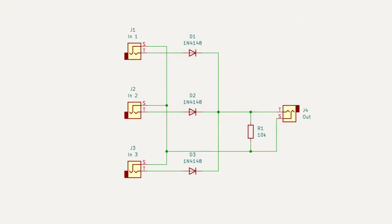There you've got the three jack inputs, and there's a diode on the output of each of those. They're all joined together and go to a single output which has a pull-down resistor across the output and ground. It's a passive circuit so there's no power needed — it takes all the power from whatever is going into it and just passes it through.